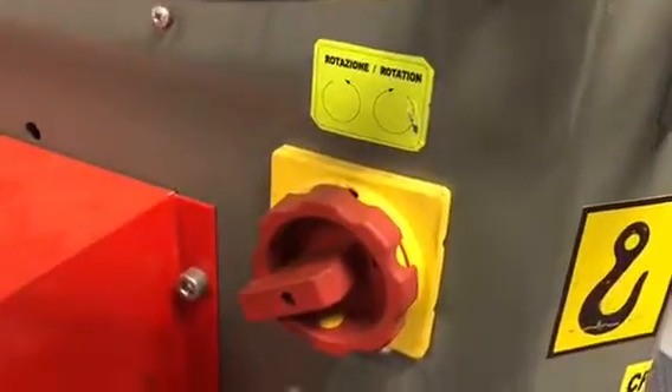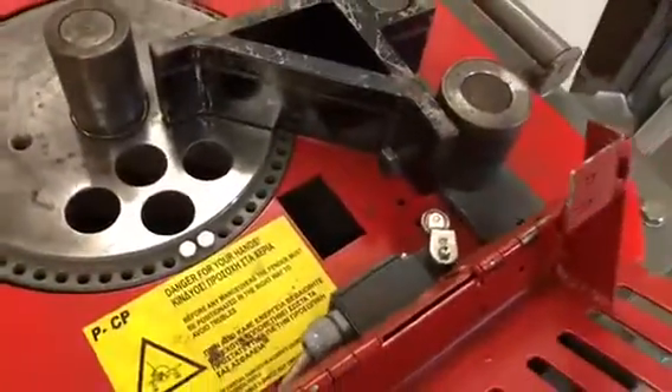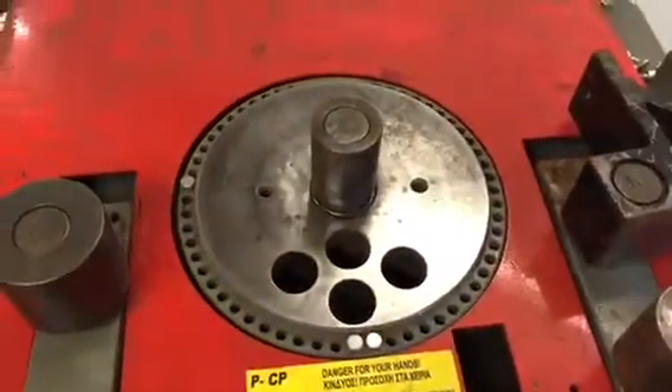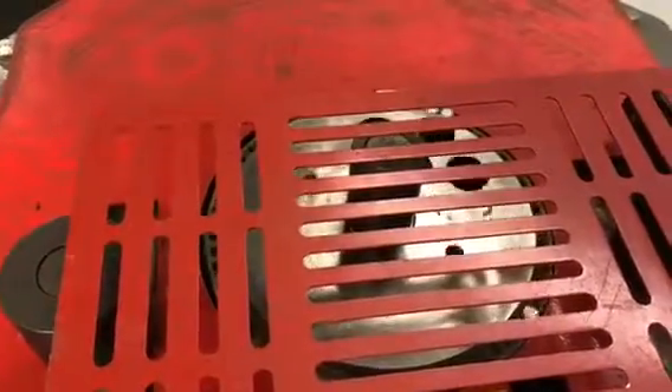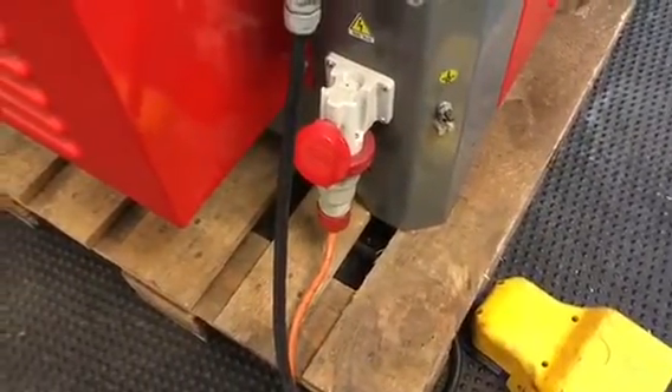The first thing to do is check the rotation of the machine — make sure the table is rotating in the right direction. We've got it set to clockwise. First thing we do is close the guard on the machine; there's a switch there that deactivates the machine for safety. Push the foot pedal — make sure there's nothing on the table that's going to collide with anything. Close the guard, press the foot pedal, and as you can see it's actually rotating clockwise, so the machine is rotating in the right direction. If it's not, you'll have to pull the connector apart to change the phasing and isolate the power, then change the connections.